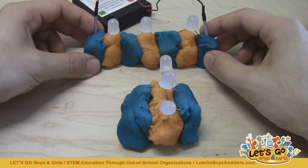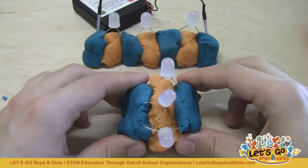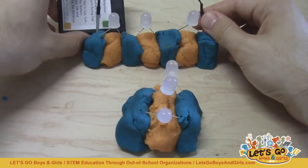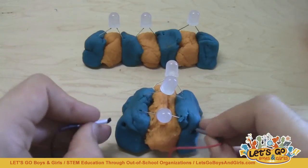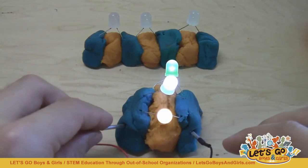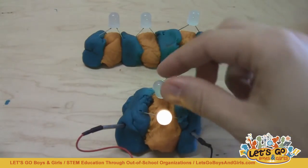It's not impossible to hook up LEDs in series — you would just need a bigger battery pack with more batteries to do so, and that gets impractical. So the result is that if you want to build a sculpture with multiple LEDs, you need to hook them up in parallel, assuming you're working with this battery pack that only has 4 batteries in it. The other advantage of hooking up LEDs in parallel is that if one of them goes out or gets removed, the other ones will stay on — like newer Christmas light strands where removing one bulb doesn't affect the others.